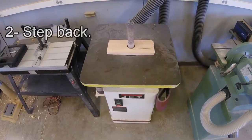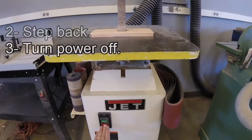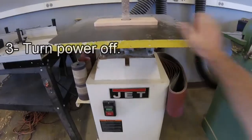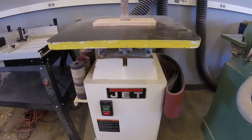Once you can establish a safe way to get to the power switch — looking at your work — you're going to lean down, watching your work the whole time, and turn off the machine and wait for it to come to a stop. Make sure you give yourself room so you're not going to get hit by any flying wood. If you can't do that, simply walk away and find somebody who can help you, or a teacher.